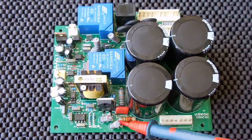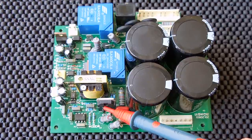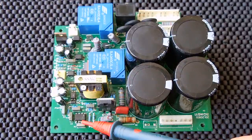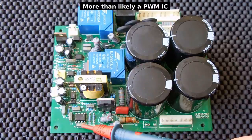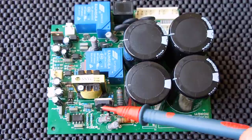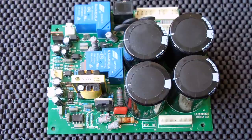I'm going to check this resistor to see if the value is within the range it's supposed to be, and check the capacitors as well. This resistor right here more than likely is the one that's faulty — it drives this little tiny transformer at a very high frequency. Over here we have another component I cannot make out due to the clear coat. If I was to make a bet I would say it's this resistor here along with either this transistor or one of these others. Let me test everything out and I'll come back and report my findings.